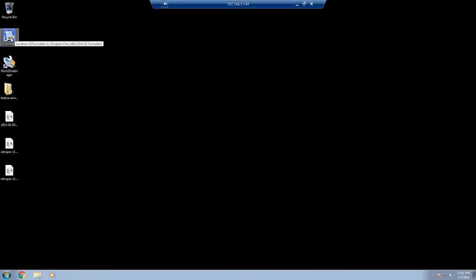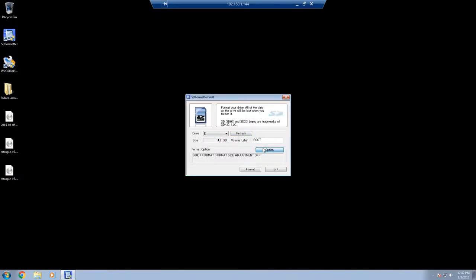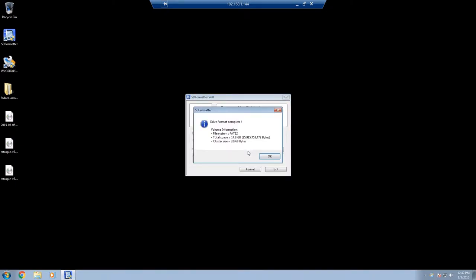I'll link all this stuff in the description. It's just a standard formatter. What I like about this one is that it will resize all the partitions if there were any on there, just by going to Option, Format Size Adjustment, setting to On. The default is off. You need to turn it on if you have used this for other Pi installations or whatever, but we're just going to do a quick flush on it. Make sure it's all ready. Okay.